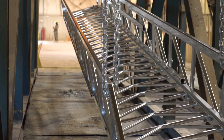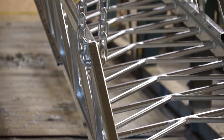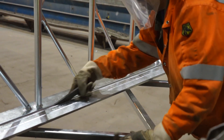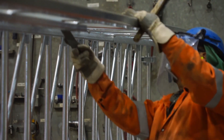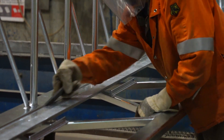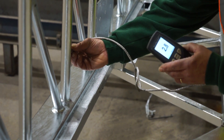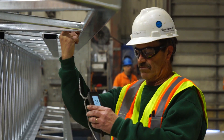Once it's done, it heads to our hot finishing area. Our material handlers clean these ladders up, get all the icicles and items off there, clean up the runs, making sure that when the firemen get this ladder they don't hurt their hands going up. There's an inspection process that we go through here and we make sure we meet everything within the ASTM A123 standards. We certify that by taking 15 readings down on the finishing end. Those are then sent into a spreadsheet, which we send to Rosenbauer or any one of our galvanizing customers, and we keep those records on hand for seven years.